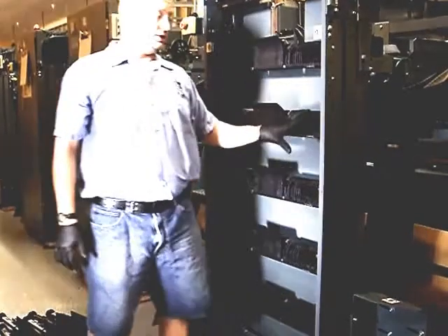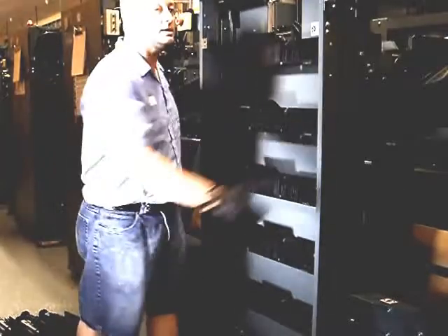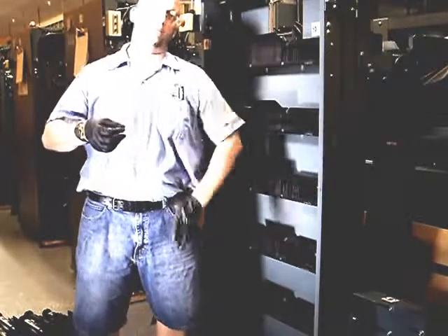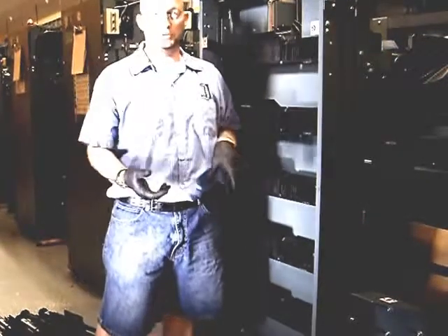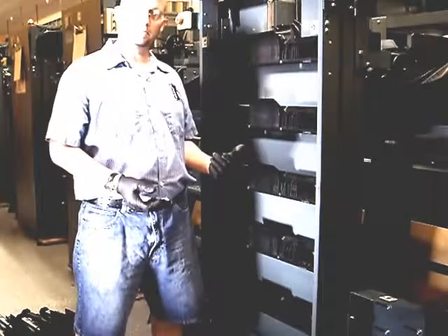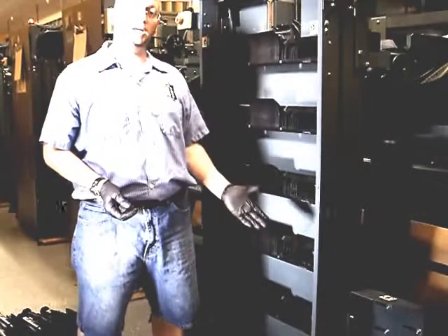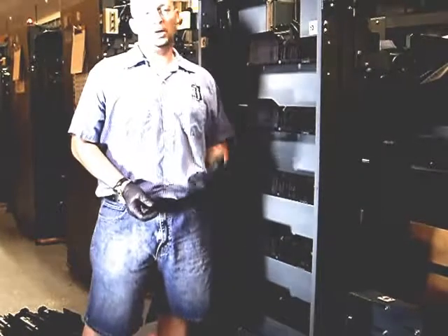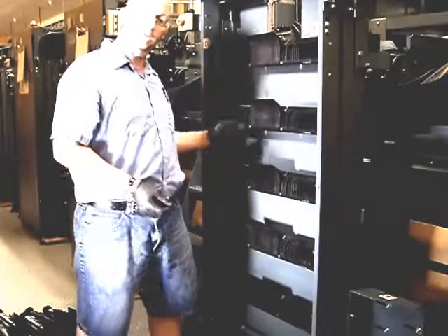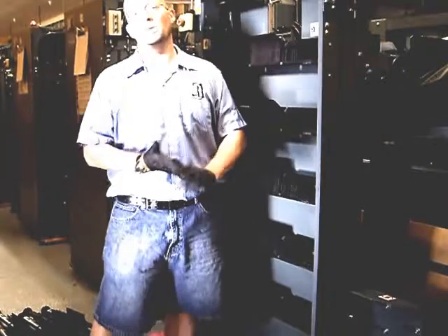I am going to pull these shovels off — they are held in there by chains on the sides. The chain works like a string on a bow and arrow: you pull back in the middle and you get enough bow to pull the shovels out. You can pull the shovel out from the left or the right side. Be careful as you pull the shovels out that you don't push the chain so far that you drop the other shovels out on you — they can hit you, and two, they can put enough shear force on that pin on the links that it will break the pin off, creating a whole other repair.